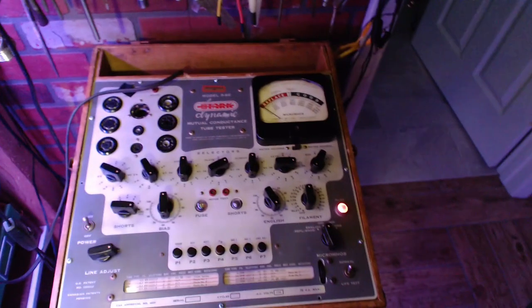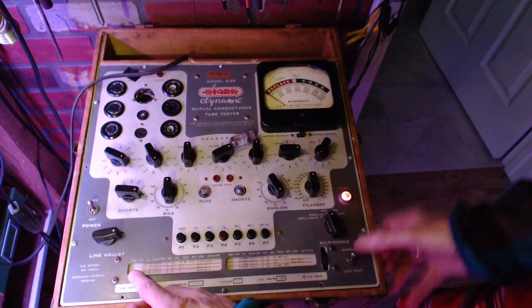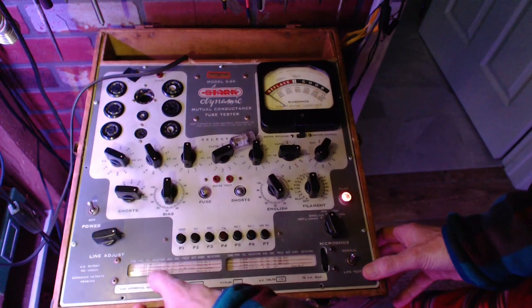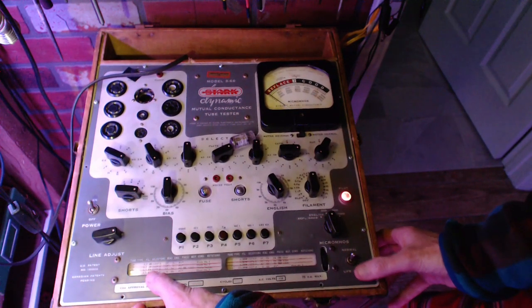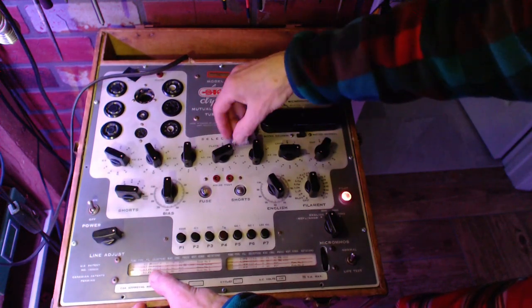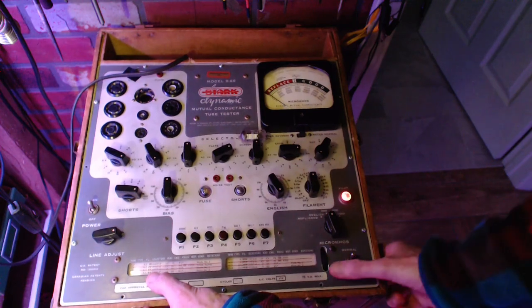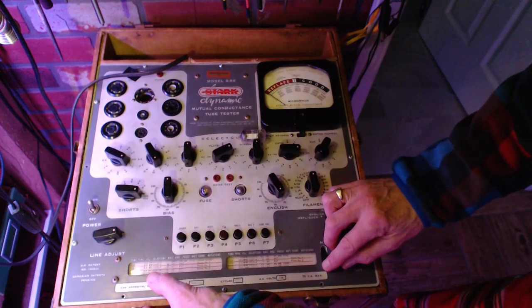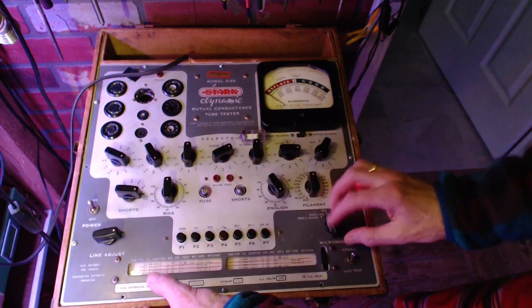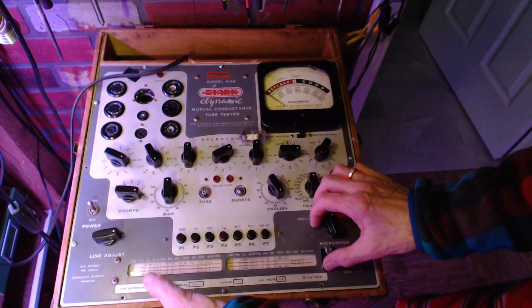And the cats are off playing together, which they often do. So we will check this. 6T8, 6.3 EV. I set it for the second one. 0607 with a 1. 0. What have I done? Oh, I see. There's three tests. There's 3 sections in this tube. So I think I must have set up for the last one. Easy to make a mistake with these, especially these roll charts, because they roll around.